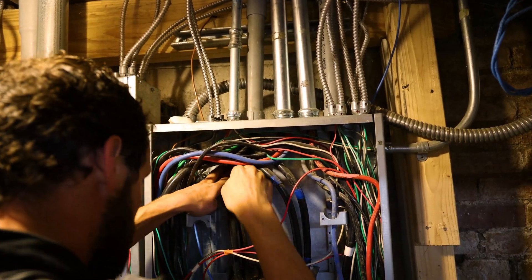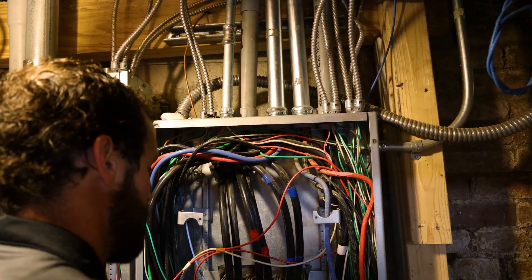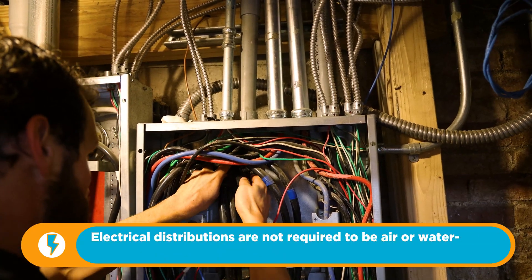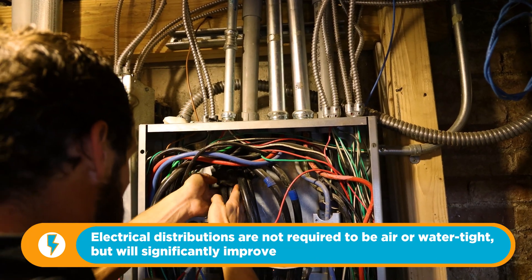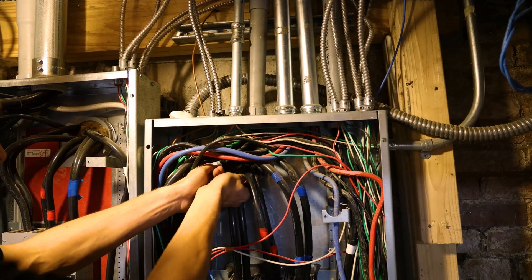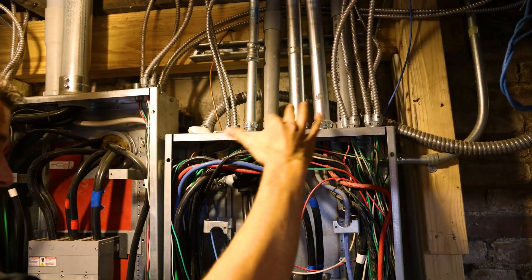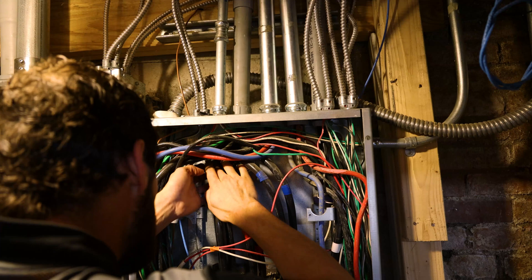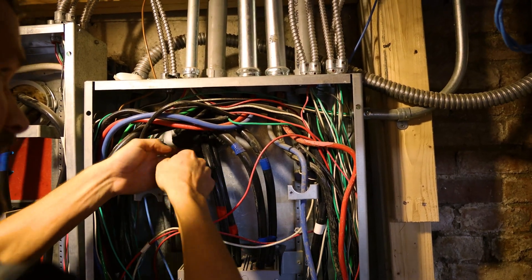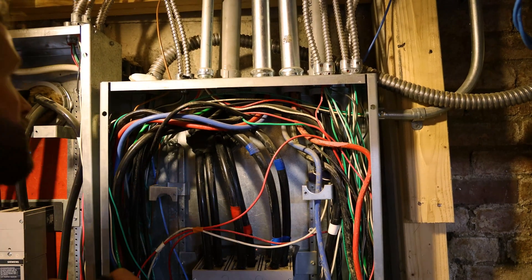Here's what happens: humidity, slow, long-term corrosion, failure, oxidation — all kinds of things that are really, really bad for your electrical distribution system. That happens slowly over time. This is not watertight by any means — water's going to pour right in if there's a failure outside or weather event or flooding. But this is going to be next to airtight, and it's going to improve the longevity of this expensive equipment. When we installed this, just the materials in this frame ran about $10,000 to $12,000 plus labor — another $4,000 to $5,000 on top of that. So this is a $15,000 installation, and the replacement cost of ripping it all apart and redoing it is double that. We really want this to last as long as possible.